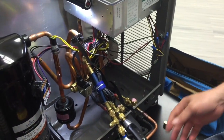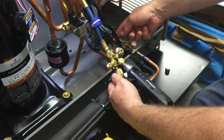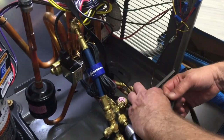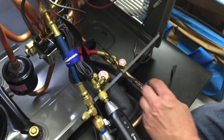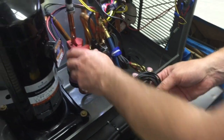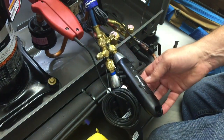Now I have my liquid line temperature and my outdoor air temperature on this probe. I need to connect the liquid line temp to my liquid line, so I'll go ahead and connect that. We can also get our discharge line temperature — I'll hook that up as well. In my bag I've got the discharge probe; I connect that on there and just leave the extra wire coiled up — no need to uncoil it.